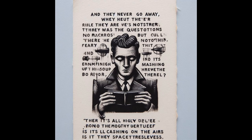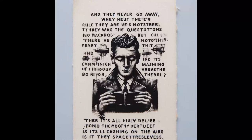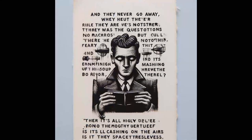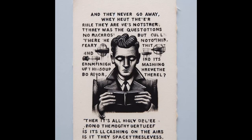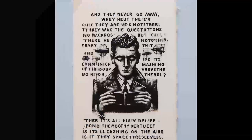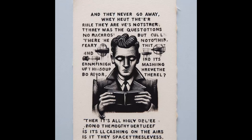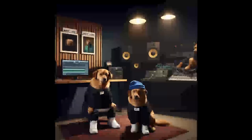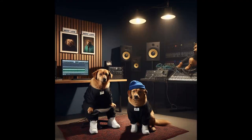1. Purity comparison. By subjecting the aluminum scrap to multiple rounds of dissolution, filtration, and recovery with fresh acids and solutions, followed by crucible melting and ingot casting, you have the potential to surpass the purity levels of traditional methods. It is feasible to achieve aluminum purities exceeding 98% through this meticulous refining process, as compared to the average purity levels obtained by directly melting mixed scrap aluminum into ingots.